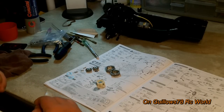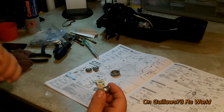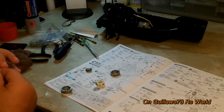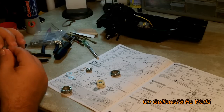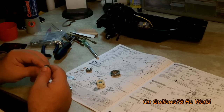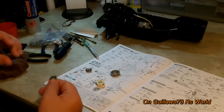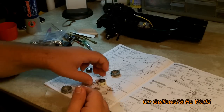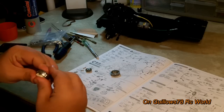Then we take the plate here, like so. That, we'll need this. Go ahead and put some grease on this here. Just grease this whole part up. Just give it a thin layer, I guess. Okay. And grab a... This here is a 9mm washer. It'll slide right on the back of that, like so. This will drop right into that gear there. We can drop this straight into the housing, like so.